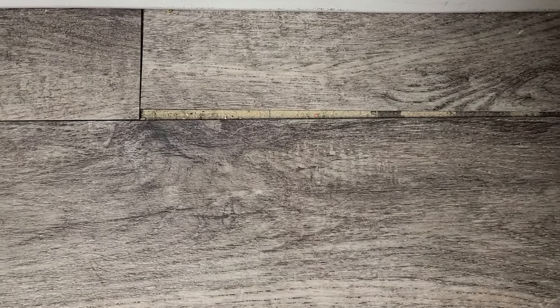Now you can hire a company to clean your luxury vinyl plank floors. The issue is that a lot of these companies are using really high pressure and a lot of water to clean your floors. And if there are any problems with the installation of the planks and there are gaps, water can easily penetrate into those gaps. You can see there are several places on this floor where the planks are not touching. So if you're using high pressure and a lot of water, you're really asking for problems.